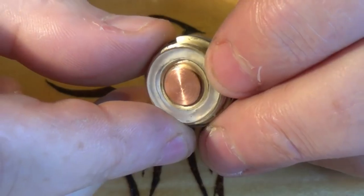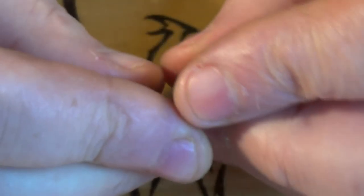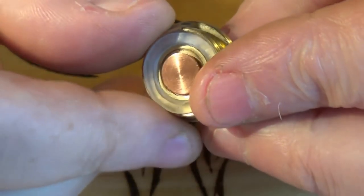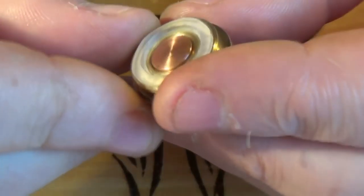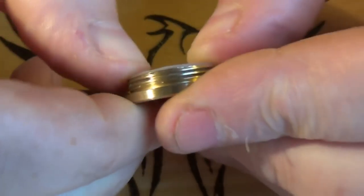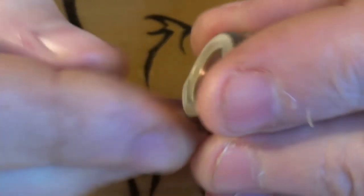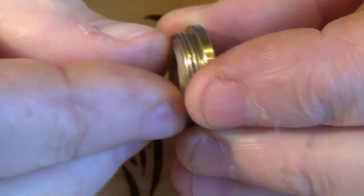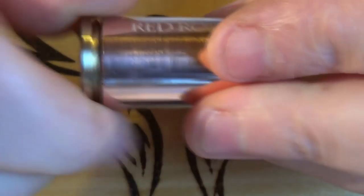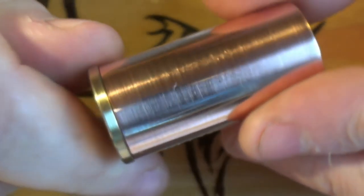There are magnets inside here. I'm not going to take this to bits — there's just a little magnet in there repelling one another, and that's all there is to it. There's this Delrin piece here which looks a bit crooked in places, but it's got a resistance to it. You push the button and it comes out past. It does take out a bit of variation in batteries because it compresses as well. You can see it just sticks out a little bit on the actual tube.